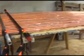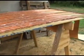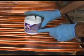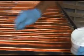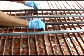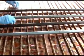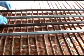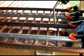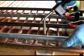Press the copper sheet securely against the copper pipe. I have found 3/4-inch black iron pipe did a reasonable job. Have lots of solder available; I use 50-50 lead-based solder for this part of the project. I also use a water-based flux for this part. This jug was good for about 3 solar panels. At this point, you can straighten the copper tubes that are wedged between the black iron pipes.